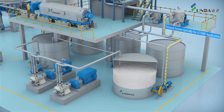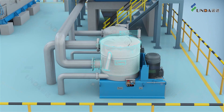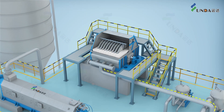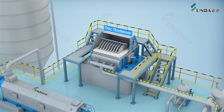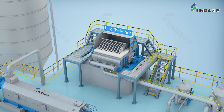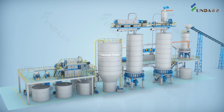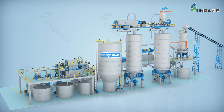After refining, the pulp stock is screened using a pressure screen to remove shives and fiber bundles. Screen accept is sent to a gravity disc thickener for thickening and then transported to a storage tower, ready for the paper mill to use.